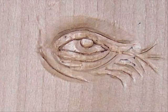Now as you push that into the wood, and you want to push it in pretty good, make sure you're not undercutting that. If anything, lean it out away from the pupil. If you undercut that, it's going to fall out. It's going to look terrible. Then to come back and do the iris of the eye, I took basically a number 5 gouge, and you just work your way around carefully, and you push it in and let it get a little bit deep, and this gives you a fairly realistic looking iris and pupil.